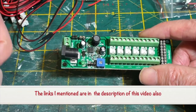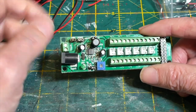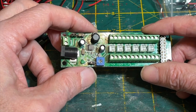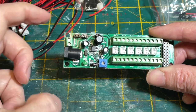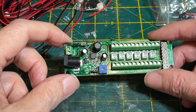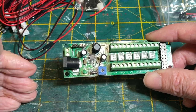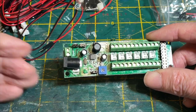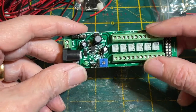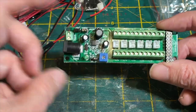The company that I buy from on eBay — there are links in the description both to the eBay page from which I bought my power distribution board and to more detailed instructions on the power distribution board, which are really quite good. This can avoid you needing to put resistors where you've got three-volt lamps; normally you would have to step the voltage down unless you have a three-volt supply in order not to blow the lamps. This clever little thing can deliver the voltage to these terminals, and you can have up to 28 lamps all of the same voltage, with one slight caveat.